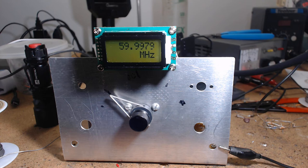If you listen carefully to a tone when doing fax pictures, sitting idle you can slowly hear the tone of the idling transmitter shift. The R71A was shifting, and on my fax machine I had a meter showing the audio was drifting, so I would fine-tune the R71A before each picture. When you try to get something really perfect, it requires more and more work and technology — like a bicycle: the lighter it got, the more expensive, the last few pounds off the frame cost thousands of dollars.